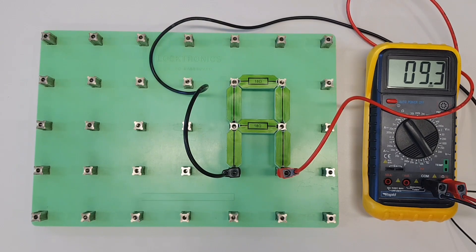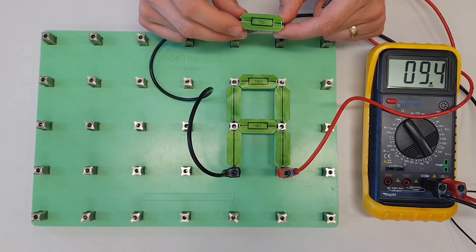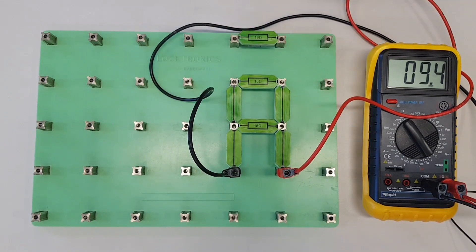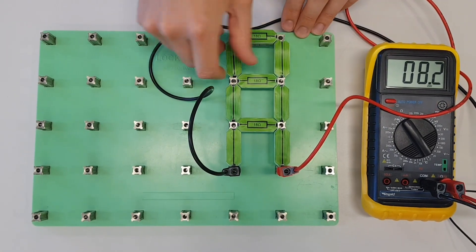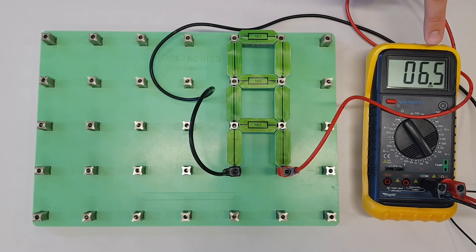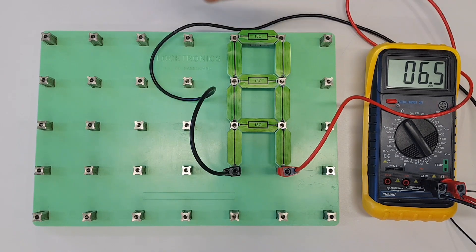But what's going to happen now if we connect up a further 18 ohm resistor? What do you think will happen to the total resistance of the circuit? What we've got now is another very simple mathematical relationship. This has now dropped down to 6.4 ohms — mathematically speaking it should be exactly 6, but we don't live in a perfect world, so it's never going to be quite perfect. But we're about 6 ohms. And you can see that 6 is simply a third of one of the resistors. We could keep going: if we added a fourth resistor of the same value, we'd get 18 divided by 4, which would give us 4.5 ohms, and so on.